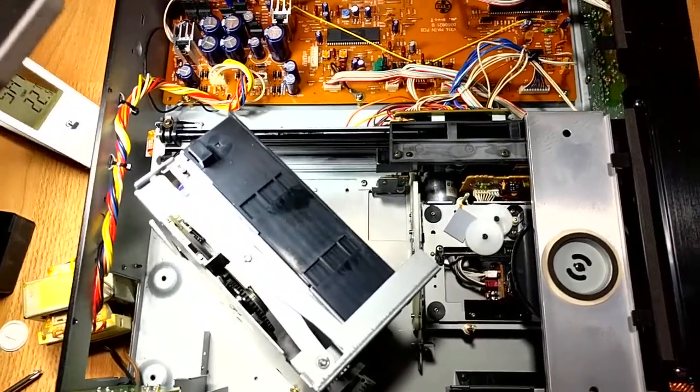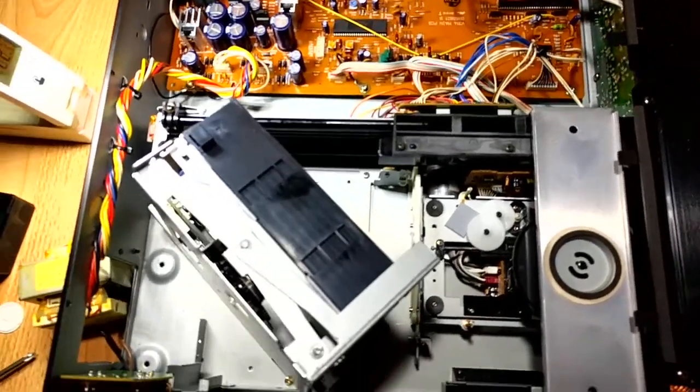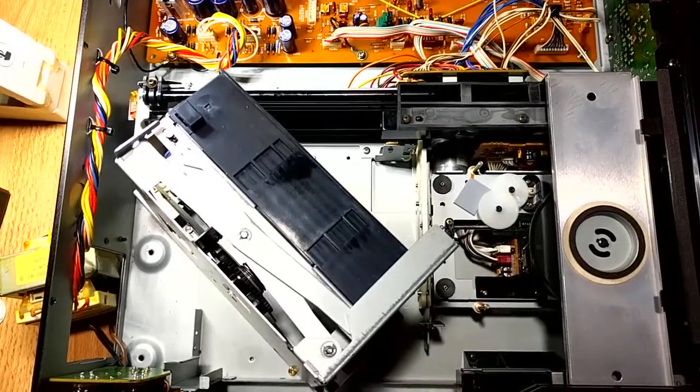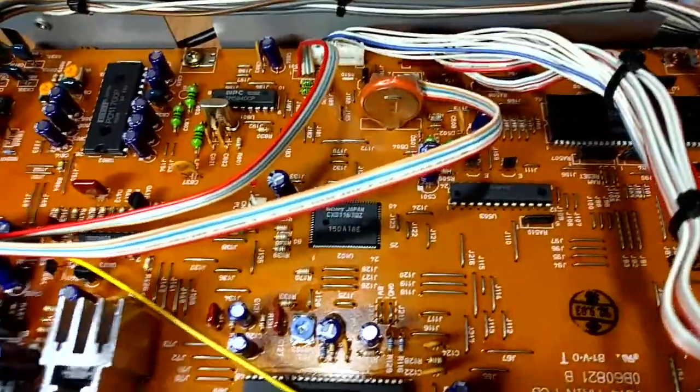All of them have it. The older ones are going to have a higher on resistance. A lower one will give you a little bit of extra power to the motor. Most of these motors are 6-volt motors operating at 5 volts or 3.3. So that's a little trick. I'll go into more of that detail in a future detailed video.